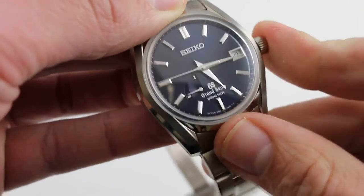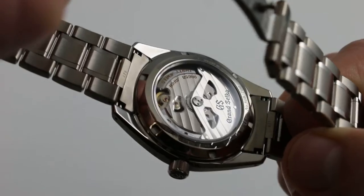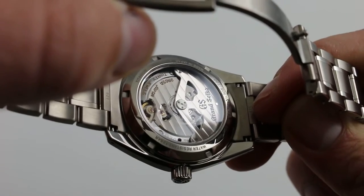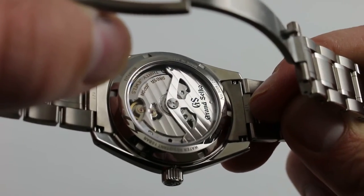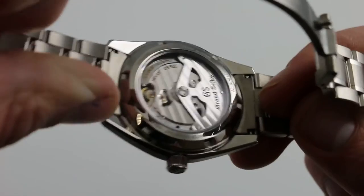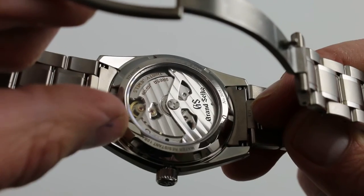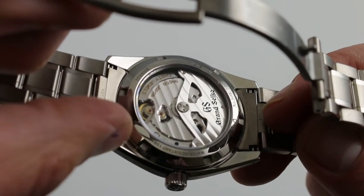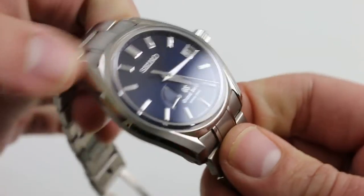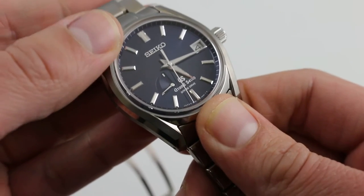You can quickly cycle the date should the watch run down. But the real highlight of this movement isn't so much the basic functions, or even the exceptional three-day power reserve, but just how it keeps time. It does feature a quartz oscillator, but it's not powered by solar energy or a battery — it is quite literally what the name implies: a spring drives the regulating wheel, which can be seen just below my finger, in constant motion. An induced current effectively provides feedback to the regulating circuit, so that the wheel spins neither too quickly nor too slowly. The result is that this regulating organ, powered entirely by stored mechanical energy in the spring, achieves better than mechanical chronometer timing standards — really a great deal closer to a good quartz watch.